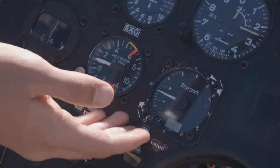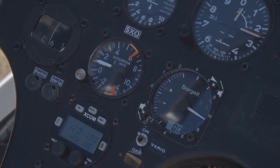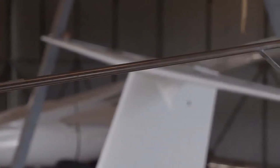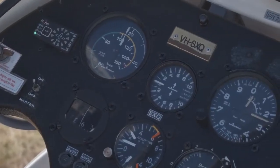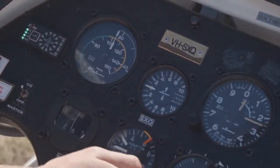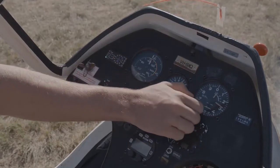Instrument checks make sure that everything is still in working order. While the accuracy is not checked during the daily inspection, we make sure that they still have basic operation. It is not unknown to have insects, like wasps and bees, make a home in the pitot tubes overnight, and water to get into the TE or static ports due to storms, or the cleaning of the glider you did earlier. Check the electrical and mechanical instruments, ensuring that there is no broken glass and they are still secure in the panel. The altimeter can be set to airfield height above sea level.